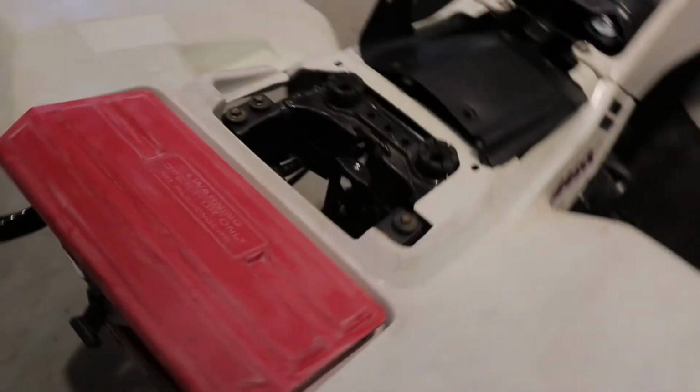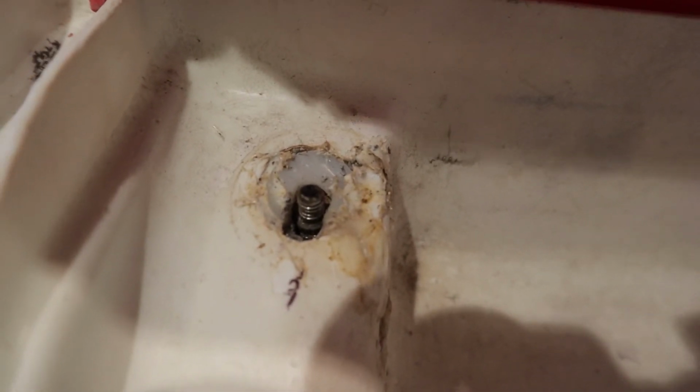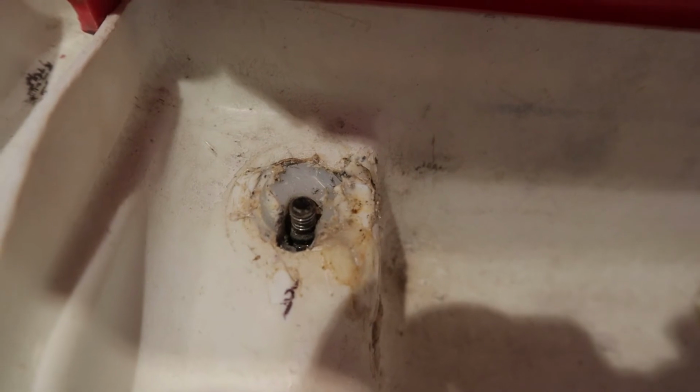We can go around back, and if you go inside the little tool area, these were totally blown out, and what we were able to do was, again, take a piece of high density polyethylene, weld it into position, and then we ground the slot. So now we've got firm material around here. We'll put a fender washer in there and a nut, and it'll actually fasten. And you can see again some of the high density polyethylene right there, welded exactly the same thing. And all of this was done with a little bit of time and a simple $15 tool.